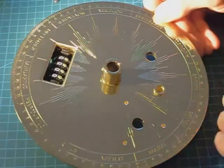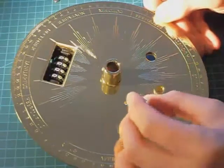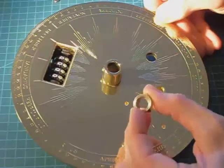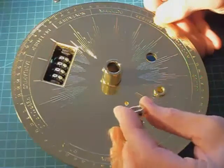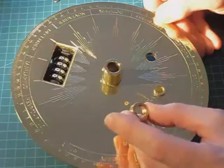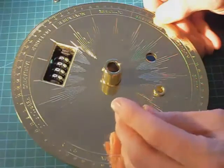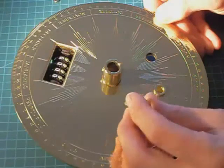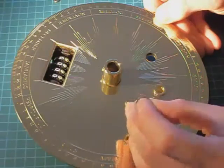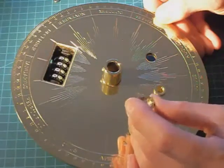The solution is to lock the bushes in place with a small brass collar fitted with a grub screw — an M3x3 grub screw. The collars have been drilled slightly oversize because there is variation in the taper and thickness of the various bushes. In this case, a small amount of shim has been placed inside the collar just to take up any slack.